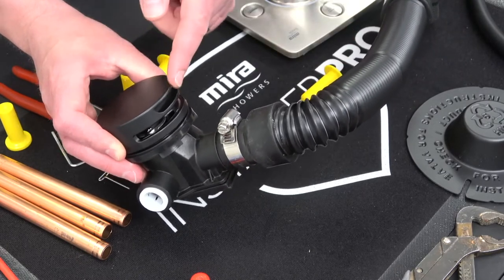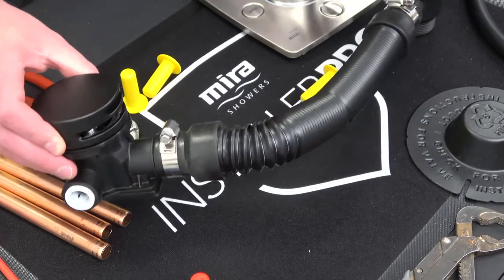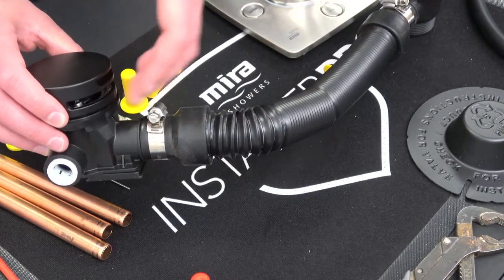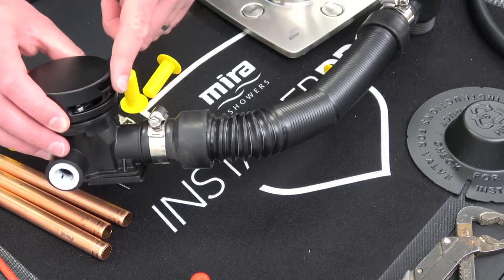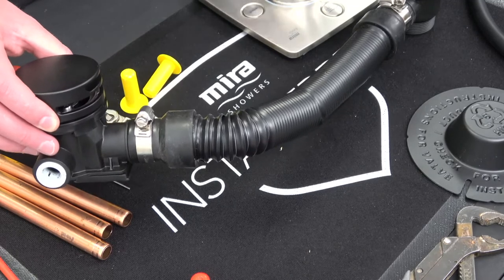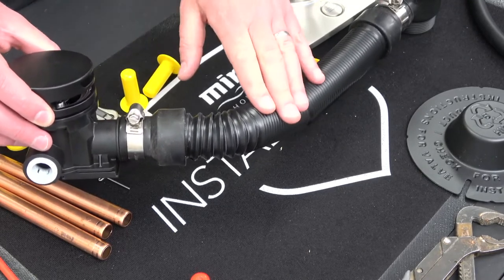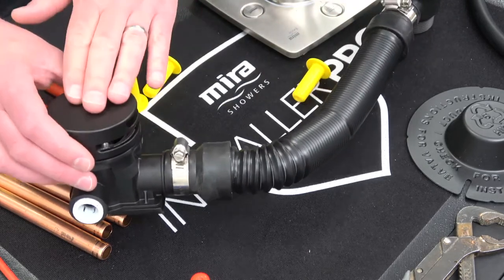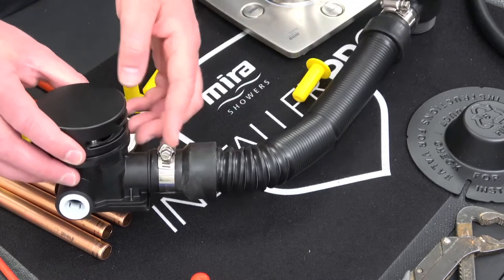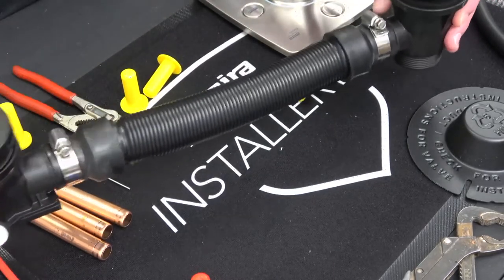But you've also got the front slot here, which is your bath fill mechanism. So safety is included as part of this. The waste will always take away more than the bath fill can fill the bath, in terms of if it's inadvertently left running, for instance. So the waste will always take away more than it can be filled by, because there's a built-in flow regulator there to ensure that it never exceeds what the waste can actually take away at the same time. So again, this comes all pre-assembled.